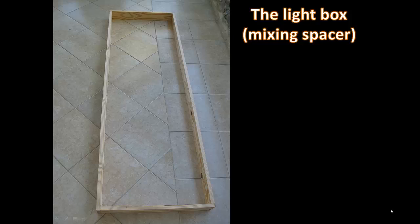Okay, let's build a frame for a light panel, for a light plane of the aperture diffuser type. These should always be assembled on a flat surface. That means a surface without very many variations. So it needs to be relatively flat, not warped or twisted. This is the tile floor of my covered porch in the Dominican Republic. I also take advantage of the tile seams as straight edges to monitor the squareness of the corners. Be sure to pick straight, untwisted, unwarped boards for this project.